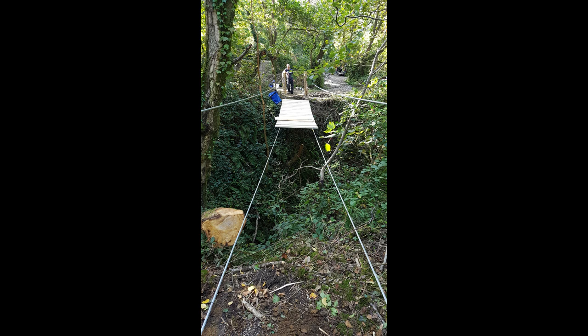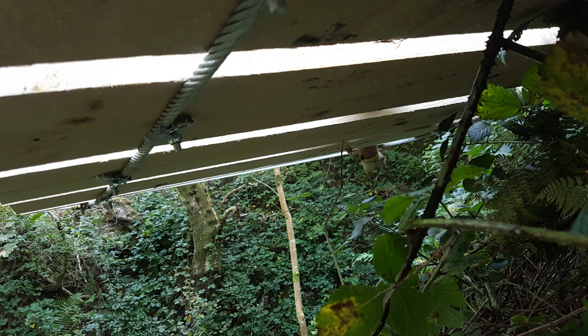Anyway, at the centre plank, number 26, we marked on the handrail where that was. And from there, we started to attach the linking stiffening wires. Now, these wires were 6 millimetres. I had ordered about 80 metres of wire based upon some basic maths of the amount of triangles that I thought that I would need in order to zip this up.